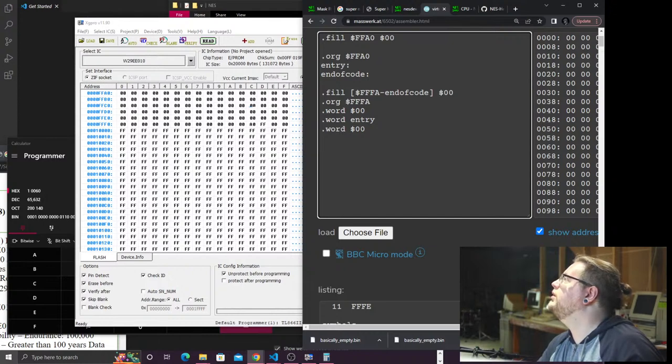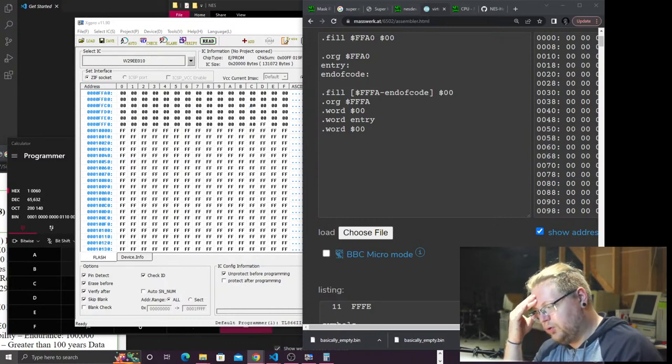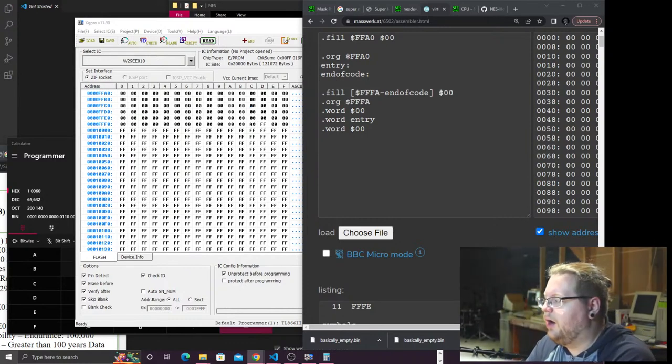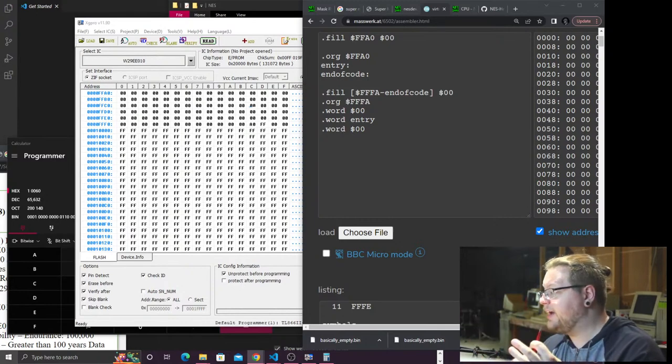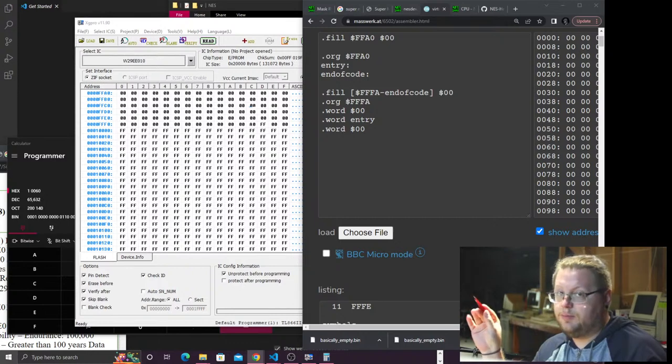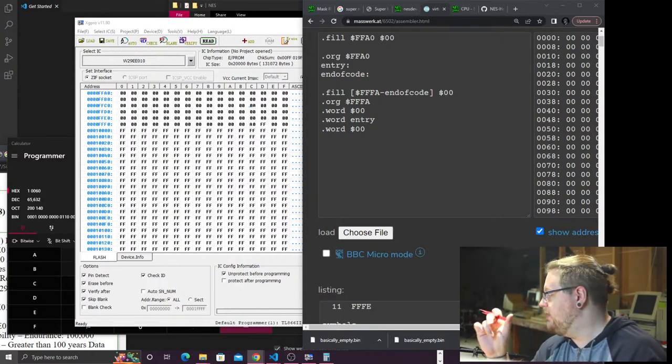There are a few online tutorials for the minimal NES ROM, as I found one on GitHub earlier. But they sit on the address buses in the cart in front of the ROM's RAM. Kind of, yes, but actually, it's interesting because I think people who haven't necessarily messed with hardware have this idea that that kind of thing actually sits between stuff, because that's the way it often looks in block diagrams. It's actually, for example, I can tell you on these cards, the data bus goes directly to the data pins on all of the chips, and the low order address lines pretty much go to the low order address lines directly on all the chips, and then the mapper is just looking at high order address lines, and then it has a couple registers on there also to control some of the super high order address lines that don't actually exist, you know, ones above